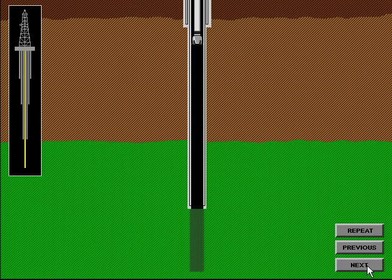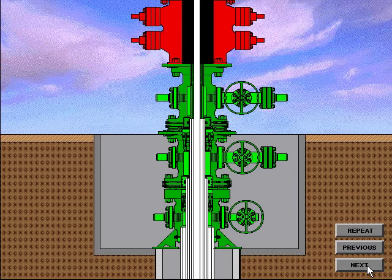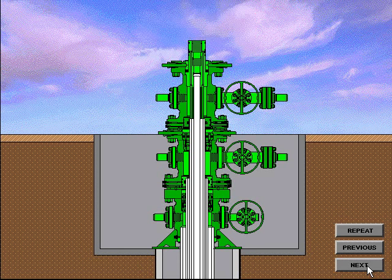When the plug has been drilled out and a clean-up trip completed, the perforating gun is run in the hole and the casing is perforated or shot. The down-hole packer assembly is run and installed in the production casing. A packer is in essence a seal assembly that isolates the reservoir from all strings of pipe except the production tubing. The production tubing is run with a bottom-hole assembly to seal inside the packer. After the tubing is spaced out and proper weight set on the packer, the tubing hanger is installed at the tubing on the rig floor, then lowered into the bowl of the tubing spool. The BOP system is nippled down and preparations are made to install the production Christmas tree.